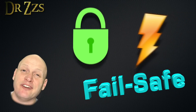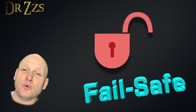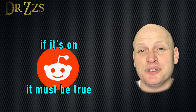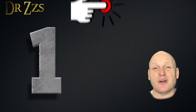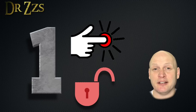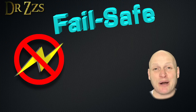One more thing — they both also work in fail-safe mode. In this case that means if the unit loses power it will unlock. There were a couple issues that people brought up a lot on DIY smart lock forums. The first is what happens in a fire. We're gonna have a button that will activate or deactivate the lock, so if there's a fire and the power is still on you can just push the button and it'll unlock. And if the house is on fire and the power goes out, because the locks are fail-safe, when the power is gone the door will unlock. So no problem.